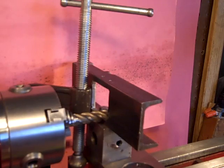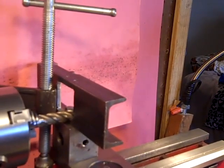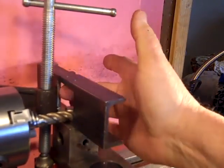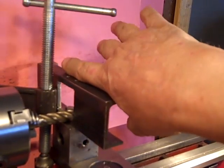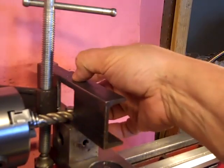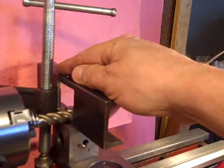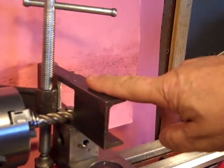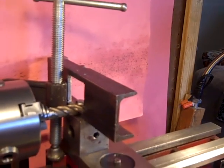And I have to make the base plate here for the rollers, which, believe it or not, is going to be pretty complicated because it all has to be adjustable, because I don't know how much room to put between the rollers, the optimum. And it's going to have ball bearings through the shaft. So anyway, I have to make it very adjustable so I can adjust it to work, basically.